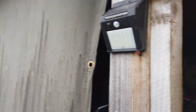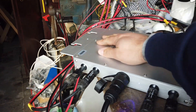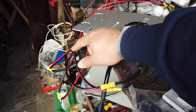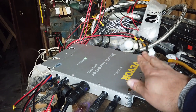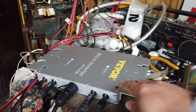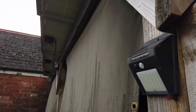Looking inside the shed we can see the V-vor unit - this is a 1200 watt micro inverter. All of the cables have now been crimped, installed and plugged into the unit. The solar panels that see the most shade I've put in parallel with solar panels that are in the sunshine, in order to try and compensate for those shaded panels. It's still sort of on the bench in the shed at the moment and I need to do more work, and the wind has really picked up so I should probably bolt those solar panels down a little better.